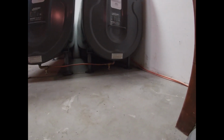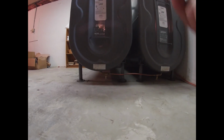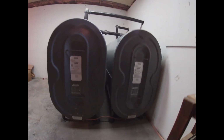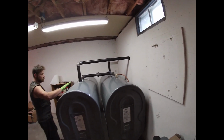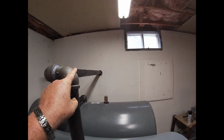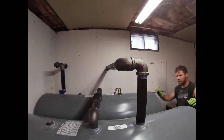And here's the bottom. They both have Firematic shutoffs. And inside there is a drop sludge tube. It actually comes up 4 inches from the bottom. So that'll allow some sludge to build up over a period of time and not clog the system. That fill pipe's got a very nice pitch because we installed that swing joint. We didn't just come up with a 90 and go out. That swing joint gives it the proper pitch.